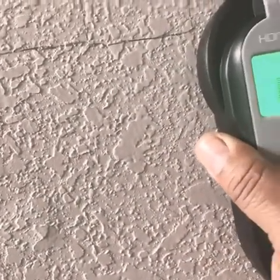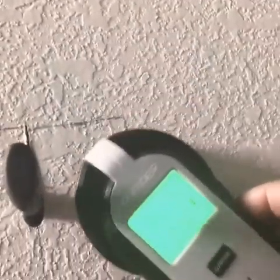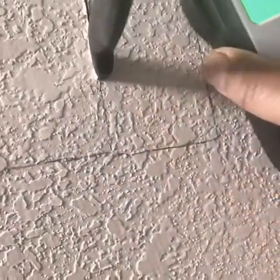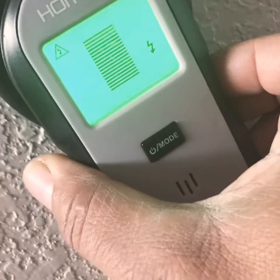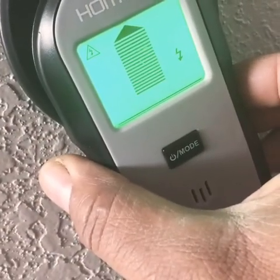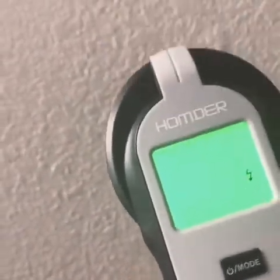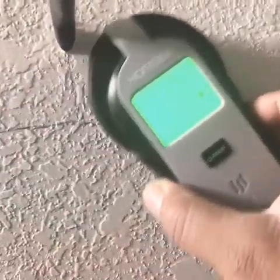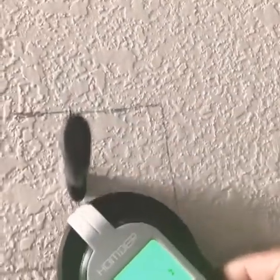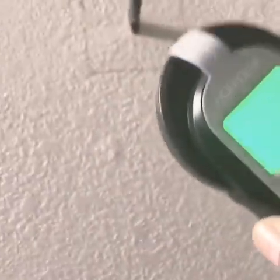I hold the side button and let the meter go, and I went all around the box outline just to make sure I don't cut into a wire. I did this while the circuit was live so I could read it — and as you see, further down I go you can see it move. Power is over here on this side, far away from where I'm trying to work. Very handy tool — it reads for steel, for wood, and for electrical. Make sure you check before you start cutting into your wall that you don't have anything electrical in that area — that's a friendly safety tip.